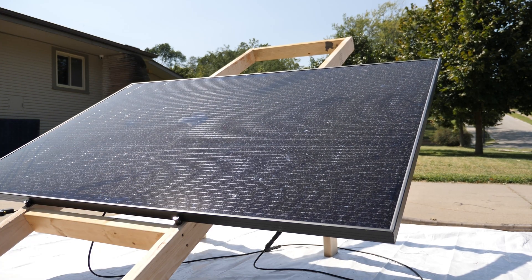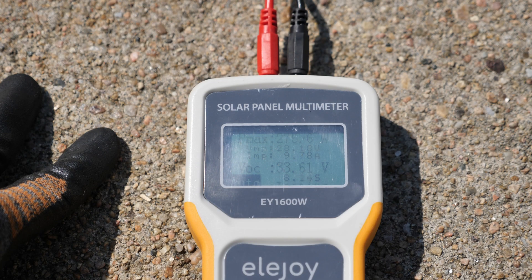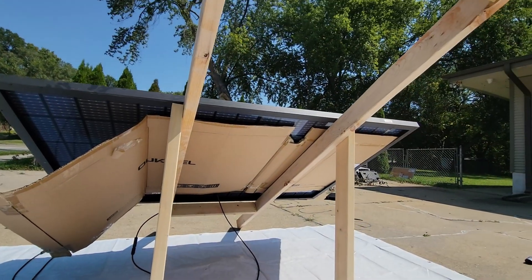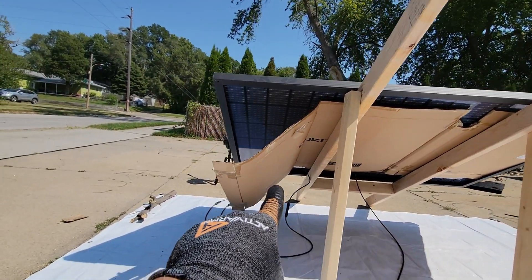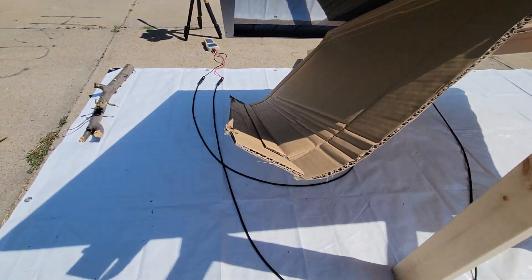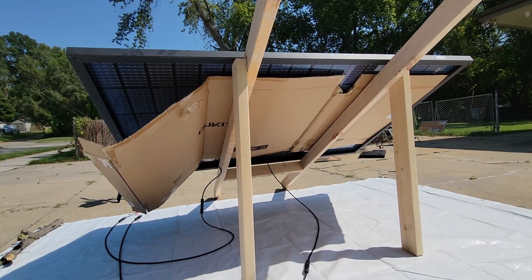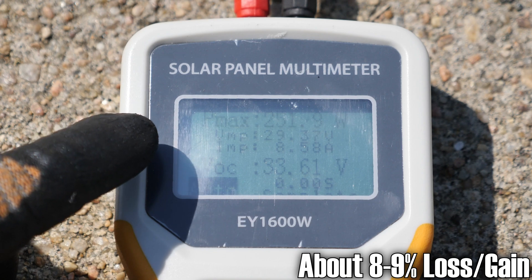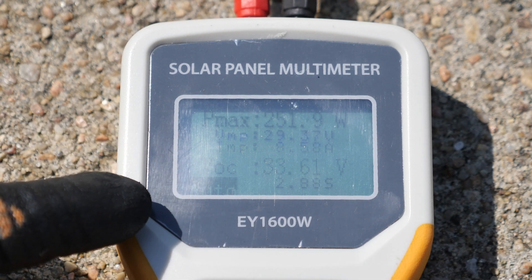With the panel facing west, I don't think this is a 100% accurate test because the sun is still really high in the sky — it would be better if this were five or six o'clock. We're getting 275.6 watts, down 125 watts. I put the cardboard back behind the panel facing west, and with a good portion covered, we're getting 251.9 watts, 29 volts under load, and 8.5 amps.